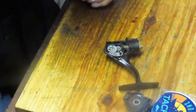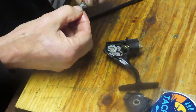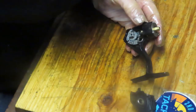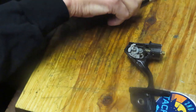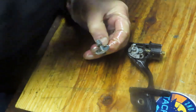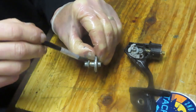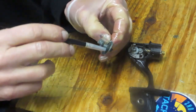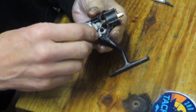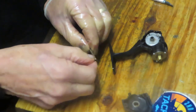Set that to the off position — it takes the switch out of the way of the case when you go to remount it, and it leaves it in operation mode. Let's reinstall the gearing. The crosswind block goes next — get a nice amount of grease on there, turn it over, and get it located over the stud. Next up is the main gear — we've cleaned and inspected all the teeth. Get a nice amount of grease; don't overload. The puddling we saw earlier is what results from too much, so a good amount but don't over-flood it.